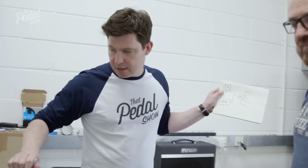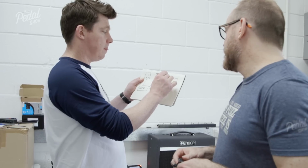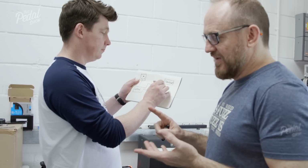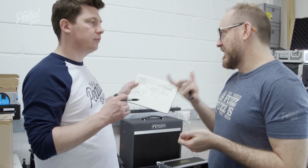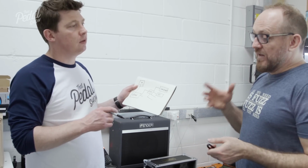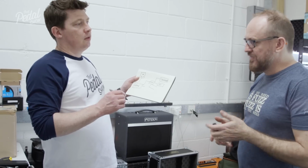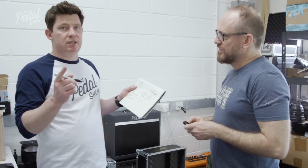And just to explain that, high current adapter, so your Time Lord, for example, what's that? So that's a 9-volt high current adapter. For things that require over 150 milliamps of current, like a lot of the digital effects, your Strymons and your TC Electronic Hall of Fame, those require a lot more than your analog effects do. So for that, we've done the Time Lord, which delivers up to half an amp of current. Okay. But it's still 9 volts, just a massive amount of current. Yeah, that these big digital effects and some of the low current valve effects need to run clean.